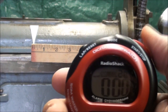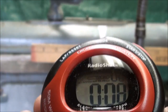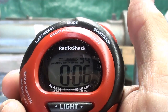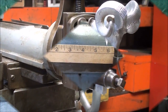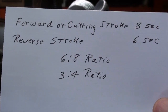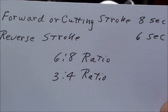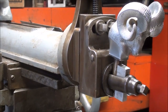Here I go, measuring the cutting stroke, or the forward stroke — and that's eight seconds. And here I am measuring the return stroke — six seconds, and I'm not counting the hundredths. So I have six and eight. To wrap it up: the forward or cutting stroke was eight seconds, the reverse or return stroke was six seconds. That gives us a six to eight ratio, or simplifying it, a three to four ratio. You can easily see here that the reverse or return stroke was faster than the cutting stroke, and that is what the Whitworth quick return mechanism is all about.